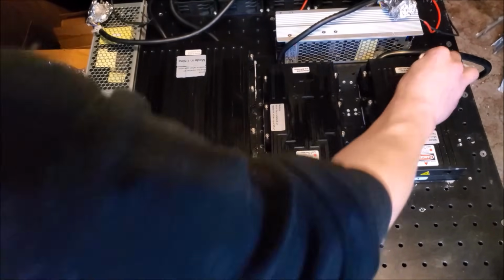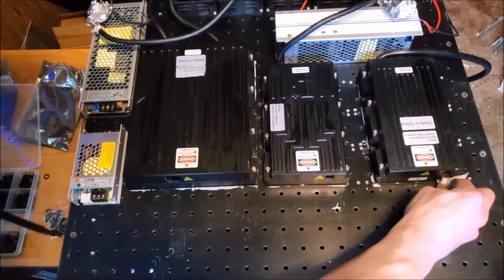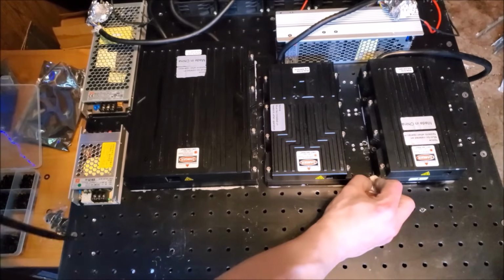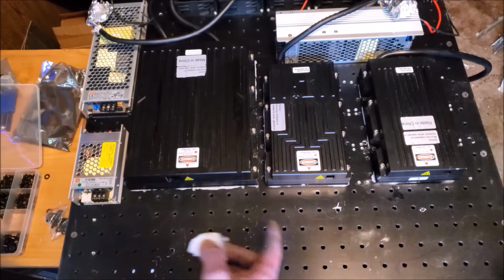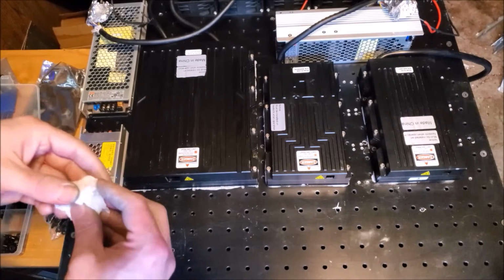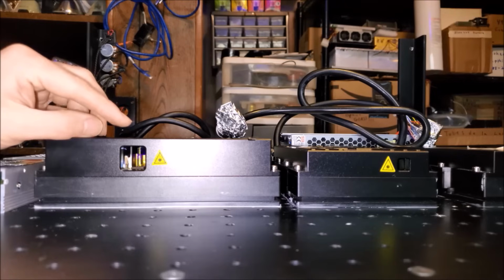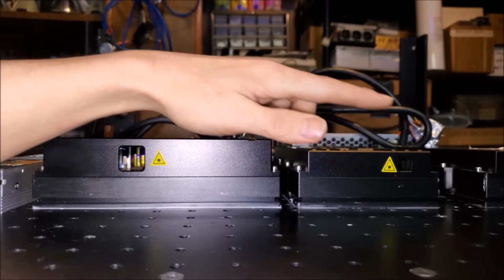Alright, make sure everything's all clean and nice otherwise. Don't really worry about the thermal paste around the edges of the laser too much. It's going to squeeze out a little bit anyway. And if you watch my channel, you'll notice that it's quite common to see a little bit of thermal paste like that around large laser heads such as this. So it's part of the nature of using that much. As I mentioned earlier in the video, the aperture for the red laser is higher off the surface of the optical breadboard than the aperture for the blue and the green laser.